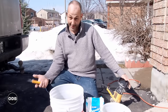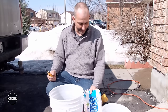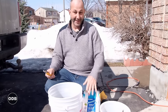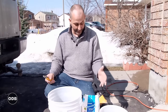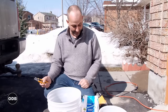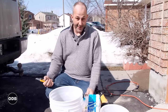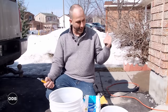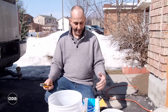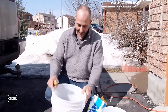Mixing your grout is a pretty simple process. Today we're using unsanded grout — this is a Mapei product with polymer. I love it: it's basic, it's simple, great uniform color, really easy to apply and easy to wash. It doesn't have any hardeners or advanced technologies because we don't need it here — we have a waterproofing membrane — so we get to go with a grout that gives us the ability to shine, polish, and form just the way we want.